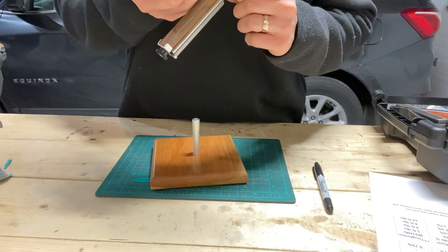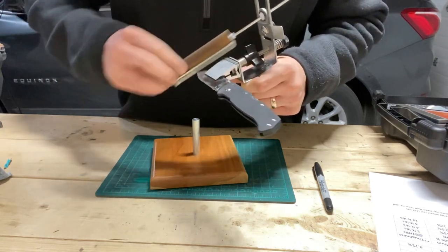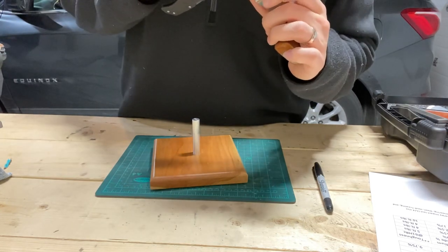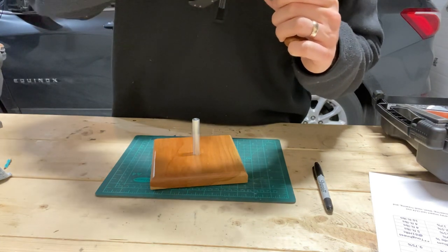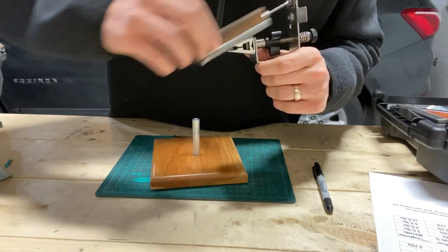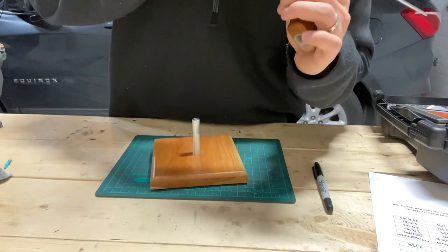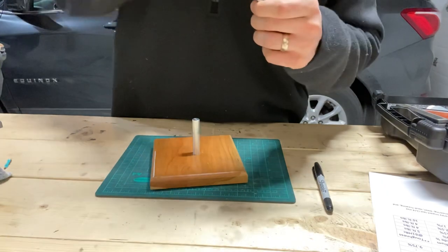Did I get it? Looks like I worked it out. Yeah, I could see the light reflecting that burr. Just a little bit. And that's where I was thinking that if I'm not hitting the burr, that means I'm not fully apexed. And that's a red flag. Now I'm all paranoid. Like I said, that 140 to 300 grit jump is really important. So I'm just really making sure that I'm flipping that burr everywhere. There might just be little spots where you're not quite getting it. I think we're pretty good here.